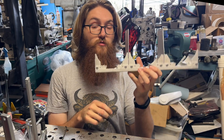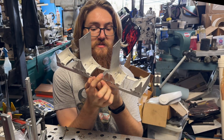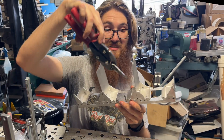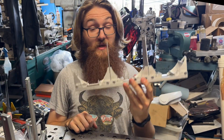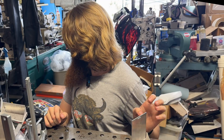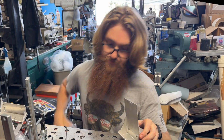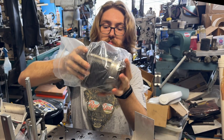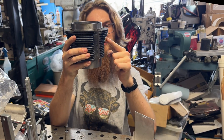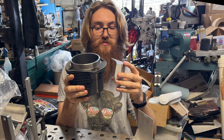I had to put big reliefs in these to fit the head studs. I've already fixed this in the CAD model and I've also modeled one of these. These VW cylinders have a very weird jump in the cylinder fins right there, so you can't use a curved deflector correctly — there's a big jump and a big gap that forms right down here. Actually, this really doesn't look that bad, I'm going to be honest, but it's not right.